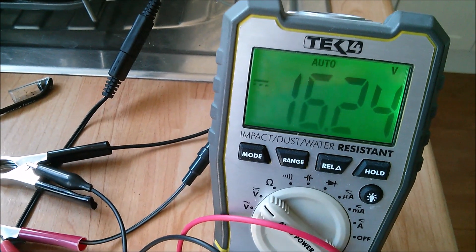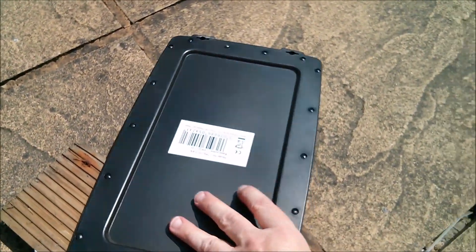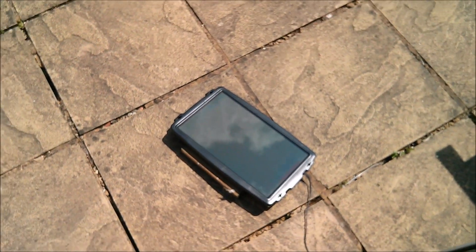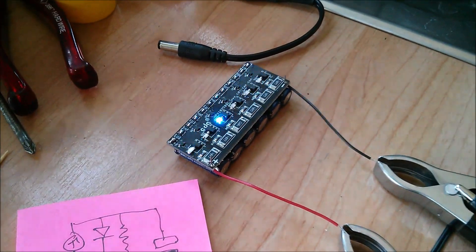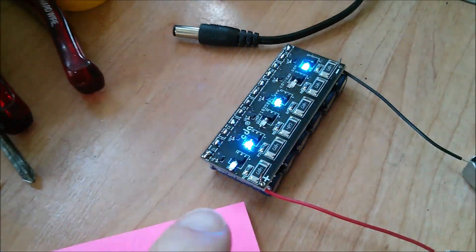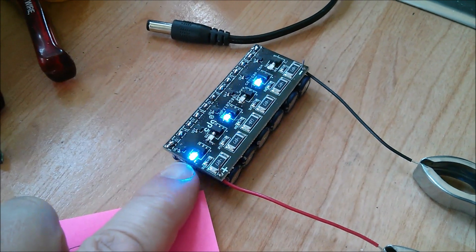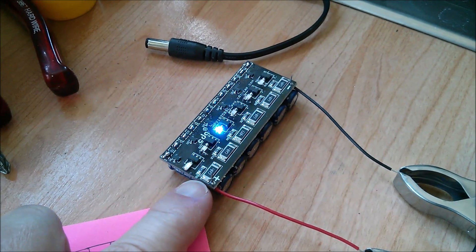16.24 — I can't remember if that's a bit less than it was when I last looked. I've got some absolutely fantastic weather at the moment, so I wanted to make good use of it by doing solar-related stuff. So that's flipped back over — we're back to these things being fully charged. The little discharging circuits: what's happening here is the MOSFETs are switching on when the capacitor reaches 2.7 volts, or slightly above, switching on a resistor to discharge said capacitor.